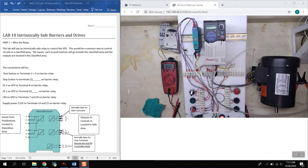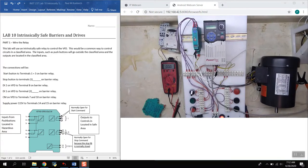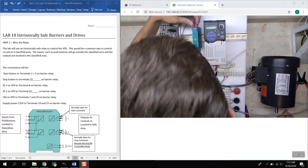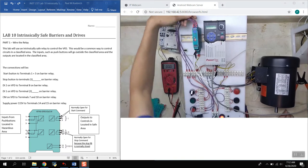If we happen to be controlling a pump for a distillation column, you might want to put the start and stop controls inside the distillation area — inside the hazardous atmosphere close to it — so we can start and stop the pump from a hazardous location. But we don't want the actual drive in that hazardous location, since it won't be intrinsically safe. The start push button wires to terminals 1 and 3, and the stop push button wires to terminals 4 and 6.